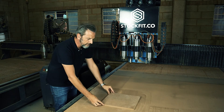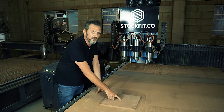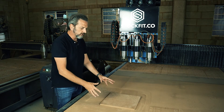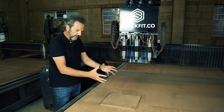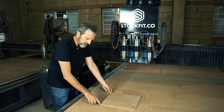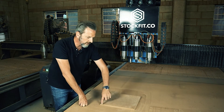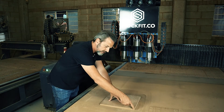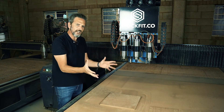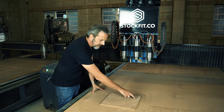On this square piece of MDF, we could set up the zero point to be bottom left corner, top left corner, top right corner, bottom right corner, or even the middle. We could pretty much have the zero point anywhere on here, but usually it would be a corner or the center point. You want to position the material and say, okay, the material I want to cut — if I zero at the bottom left corner — the machine has to know there is material to cut within that limitation. Your material always needs to be slightly bigger than the actual item you're cutting, and your zero point should always be within the limitations of the material you've placed.